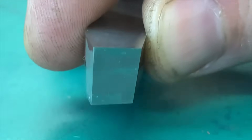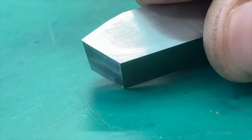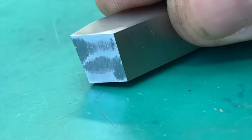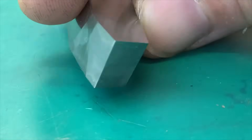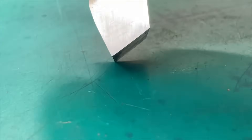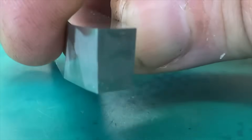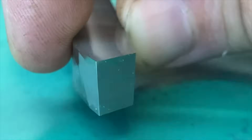A good way of getting a really nice finish on brass and a really fine cut is to use a tool of this form. As you can see there is relief on two sides, but there is no chip break, there is no top relief — it is just flat. This also means that it is very easy to sharpen, just by touching up the two sides.